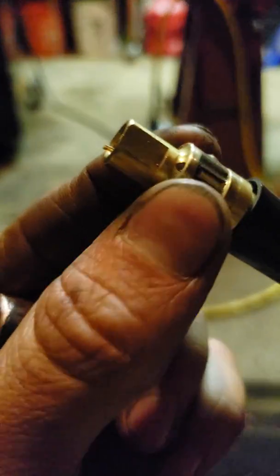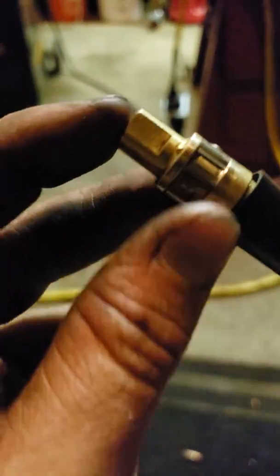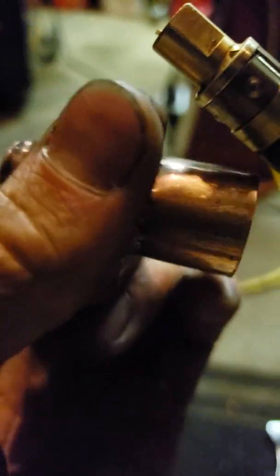For some reason my cap is not pinching this, or something's malfunctioning. I tightened down this tip — I took the copper tip off so I could tighten this down — and I cleaned the heck out of this. I'm going to weld with it again to see if it's going to work, but I think I either need to get a new ring or replace this tip right here.